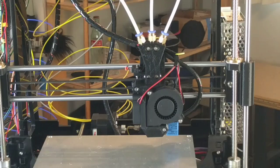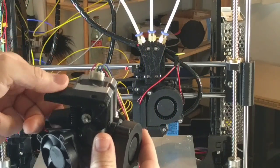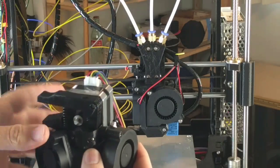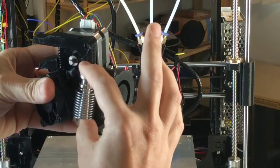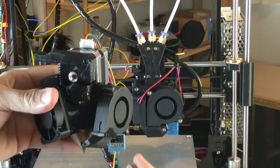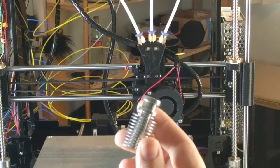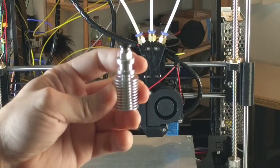I've been working for the last couple of days on this new design. There's a direct drive right there with a loading lever — all printed — feeding into an E3D V6 hotend and into the cold end, the radiator part. I had to order that special cold end separately, because it's different from the cold ends that come with the diamond head, which we'll get to in a second.